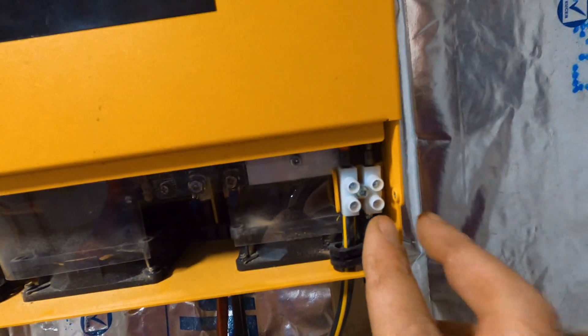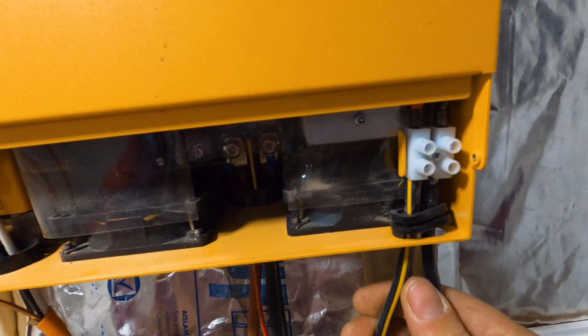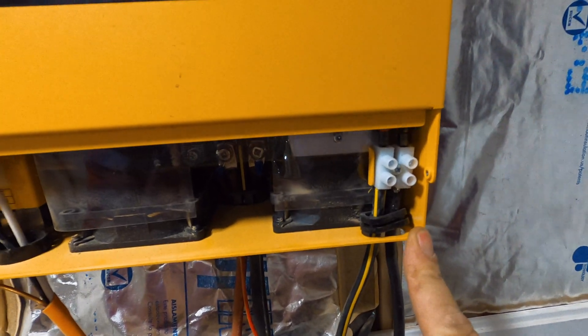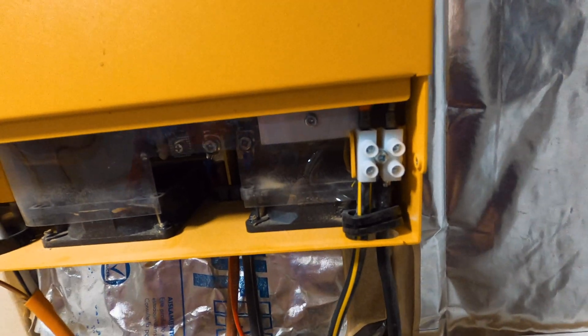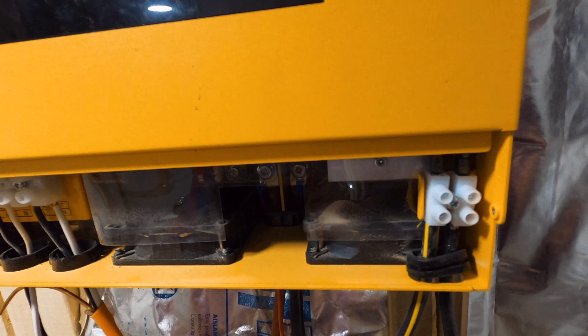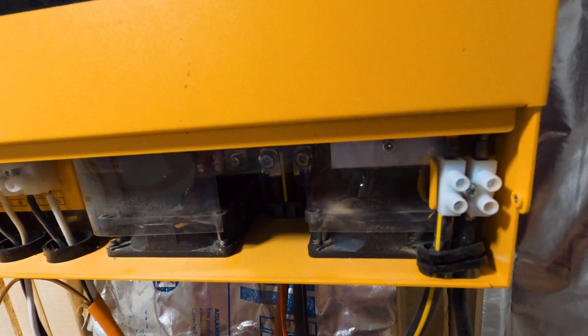And then this is your solar panels input — you only have one set of terminals. You've got to string them in series. You can have up to 145 volts coming in, but MPPT only works between about 60 volts and 125 volts.